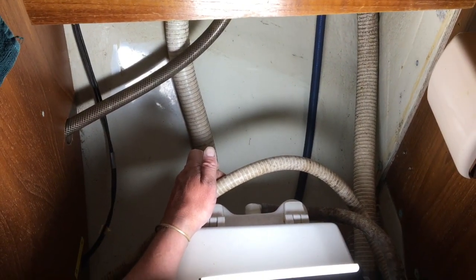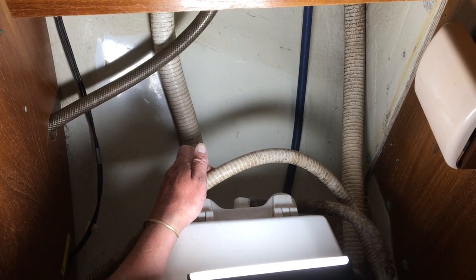There's no anti-siphon on this intake either. The intake should run almost to the underside of the deck with an anti-siphon, because there is a risk of flooding the pan as this is just below the waterline.